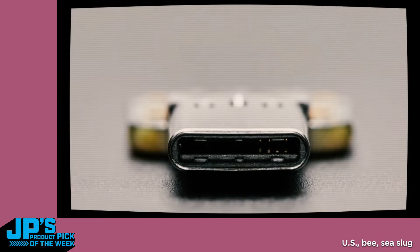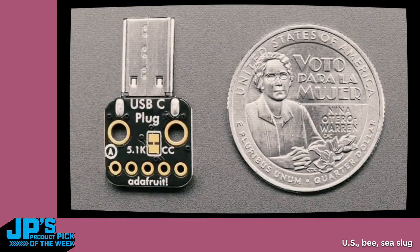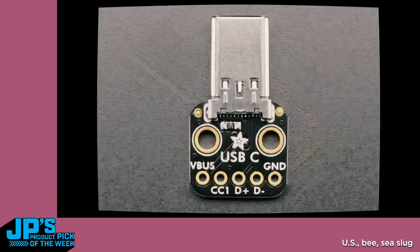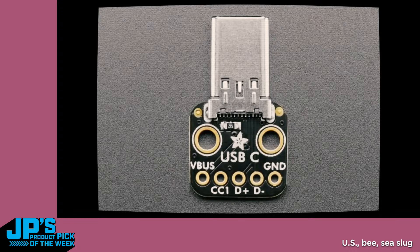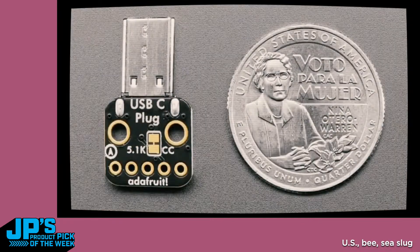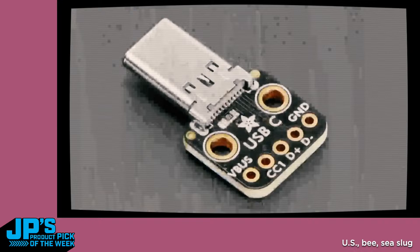We wanted to have stuff that plugs directly into a USB-C port. We wanted to first find a really good USB-C plug — something that has all the pins we need and is edge mounted, so you can plug a device straight into a USB-C port but doesn't require an external case to keep it mechanically stable. This is a nice plug because it has a little through-hole tab, but still has plenty of pins. It's fairly easy to solder, not too expensive, and it has the power and data pins plus the CC1 pin. A lot of people ask, don't you need the CC2 pin? Not on the plug.